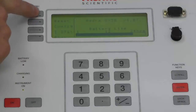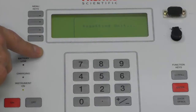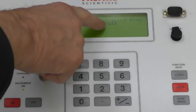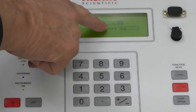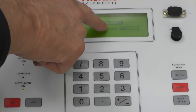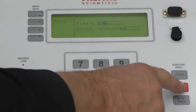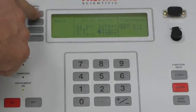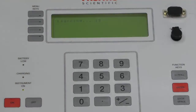We need to set the instrument up. I'm going to hit the soft key adjacent to Reset, so I hit Reset — Set up flow meter, Yes. It's resetting the unit. Now it asks me whether I'm going to do an auto setup or a manual setup. I scroll to the auto field and hit Enter. I've got to put the pipe internal diameter — in this case it's 63 minus 8, which is 55 millimeters internal diameter, so I'm going to put 55. It's already on millimeters, so I push Enter. It jumps field and we're going to operate in liters per second — we can change these units if needed. It's now setting up various ranges and doing a self-learn, which takes about 15 or 20 seconds.